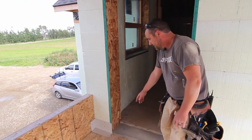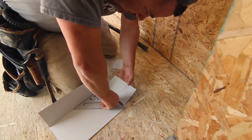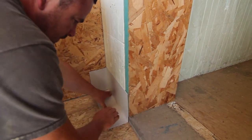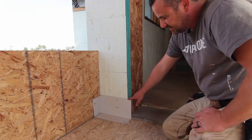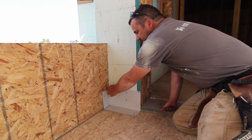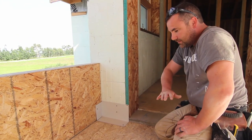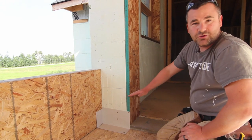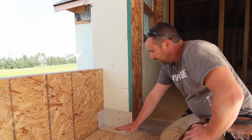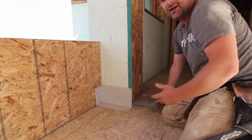This is how we do the prep for an ICF. I just get these pieces of metal made. I bend them at 85 degrees so they're spread open a little bit — that way when I tuck it tight into the inside corner, it holds tight against the wall. It has a hem on it — I'll show you on a piece that's not installed yet. Then I just shingle nail into the snap ties. I had to bend around the corner here because there was nothing to attach to, so I just pushed in tight and nailed it there. Once I go around and finish all those, we'll do quarter inch plywood. Because it's quarter inch, we'll glue the living out of it and staple it. That'll cover the metal, and then when the vinyl deck guys come in, they can wrap up this wall and onto the metal. That's how we prep for our ICF.